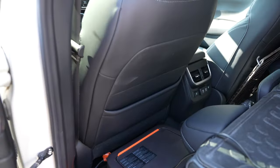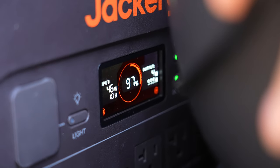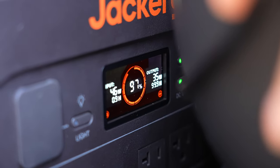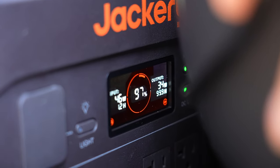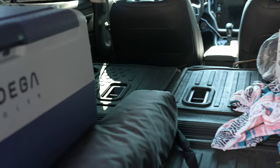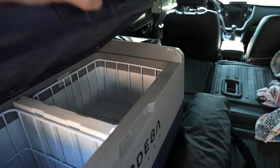Now I'm going mobile — it's mounted through the roof, that ain't going nowhere. I just have the cable sitting right here coming in the door — it's fine for right now. When I put it on the truck I'll actually make it a permanent installation. Let's take it outside and see if the Jackery is charging. The Jackery is getting 46 watts right now, looks like it's 0.8 hours to fully charged. The fridge is pulling 35 watts — it'll get up to 60 once it's fully ramped up. The Bodega cooler is sitting right here on the side with drinks and frozen items inside.